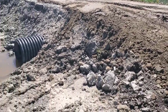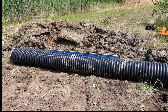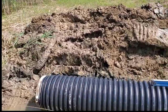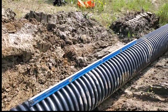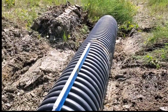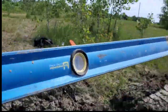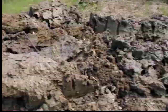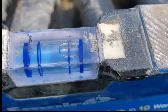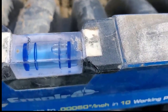I'm installing the Boffman 18-inch dual wall heavy-duty culvert pipe. I want to make sure you guys get it right — everybody out there can be successful at their DIY projects. You don't have to be a pro; this isn't that advanced. Make sure you get a really long level, and you want the bubble to be upstream — not level, and definitely not downstream. Upstream is what you want.